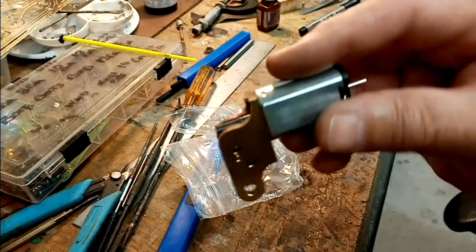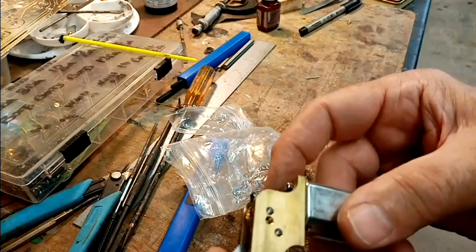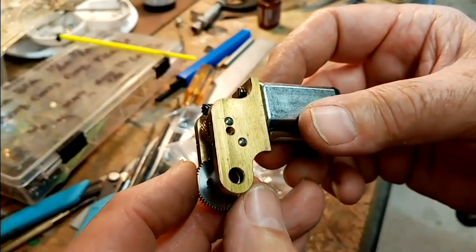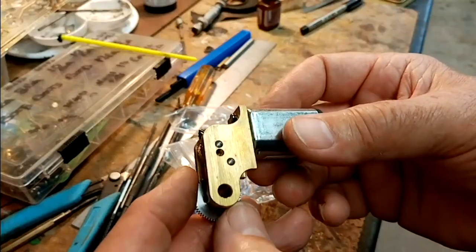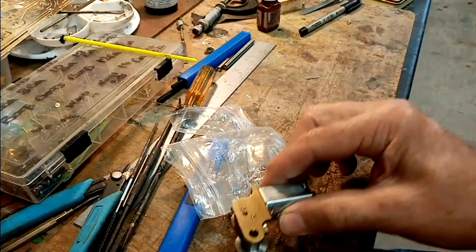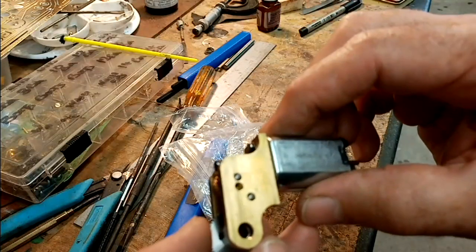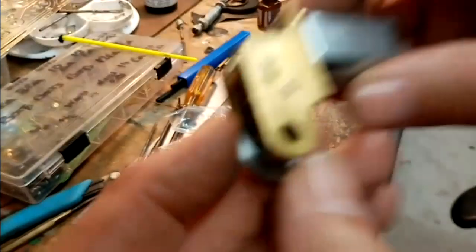The motor I use is a three-stage Ron Chaplin type motor from MSC. I've used these on a number of engines, and I used them when they were by Ron Chaplin, and I've never had any problems with them. They're nice and smooth. This is not to say that other motor gearboxes are not suitable, but this is just my preference. I normally go for a three-stage motor gearbox on a big engine, but with the paperwork, I ordered this from MSC through the post, and it really says that for a big passenger engine, a two-stage gearbox, which is a bit cheaper, is a better bet. But I've got this now, so I'm going to fit it in.